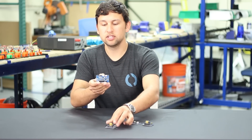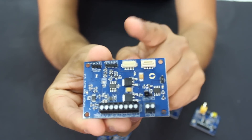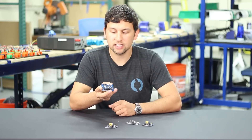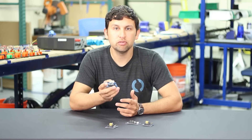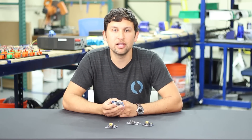There are also two specialized ports on the ROV side board. The first is a DF-13 connector, making it easy to connect to a PixHawk or APM autopilot. The second is a JST-GH connector, which complies with the new Drone Code Mini standard and allows you to connect to a number of current and future autopilots.